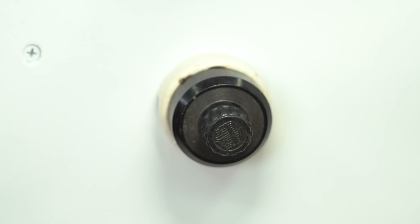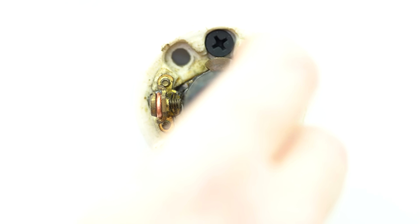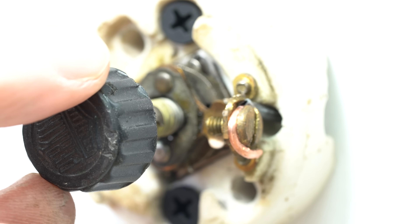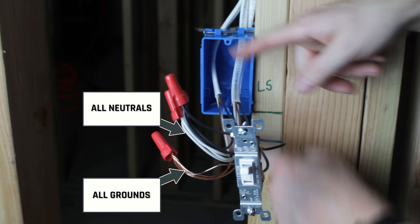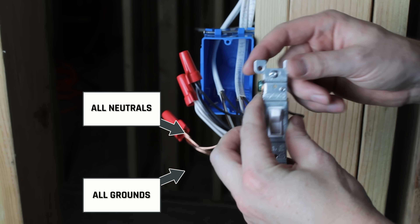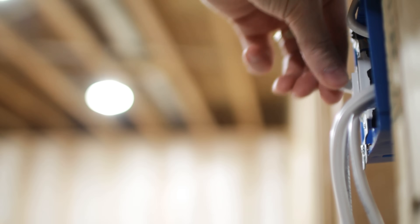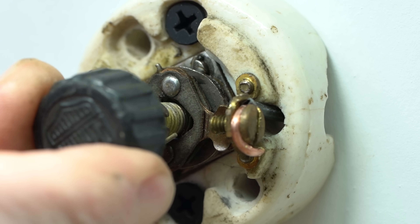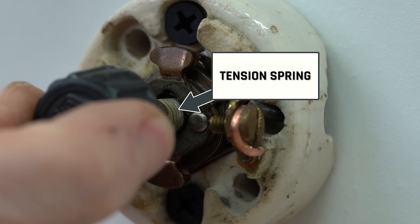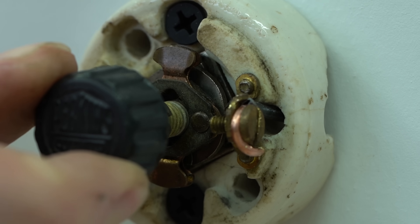Let's take a look at this light switch, which is based off of Holmes' patented idea. This is called a rotary switch and was in every way a huge improvement over the old Frankenstein knife switches. In general, lights are turned on or off by closing or opening an electrical circuit. In today's wiring, ground and neutral wires are almost always connected all the time, so all the light switch has to do is connect or disconnect the live or hot wires. If the hot wire is connected, the lights turn on; if it's disconnected, the lights turn off. These early rotary switches used a spring on the inside to make it easier for the switch to always be in one position or the other, and they made it happen quickly.